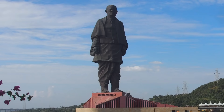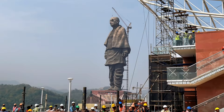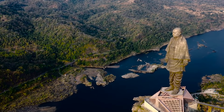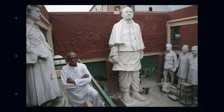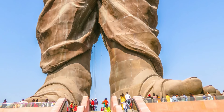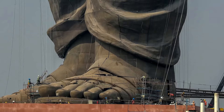The hillock on which the statue stands was flattened from 70 meters to just 55 meters so foundations could be laid. Among the many thorny engineering problems, the most striking related to the statue's slenderness ratio — tall structures should ideally be more slender at the top than the bottom. However, Sutar's sculpture of Patel is clearly narrower at the base, and the statue's progressive stance means those sandaled feet are some 6.5 meters apart. Engineers decided the best solution was to create two separate concrete cores, the same kind seen on skyscraper construction sites.